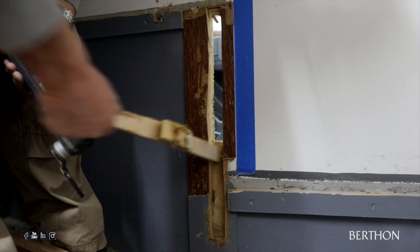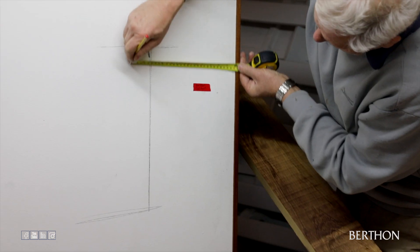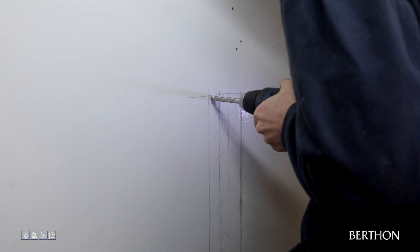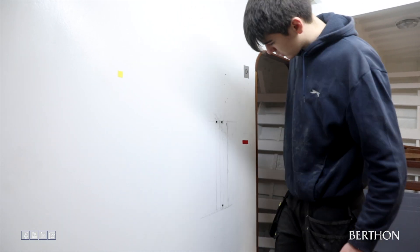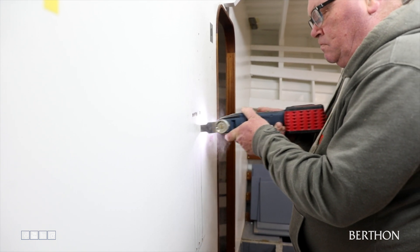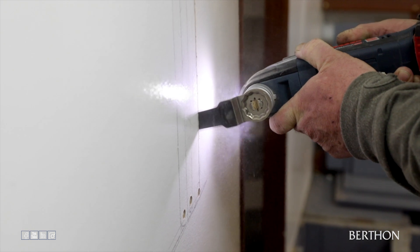The ends are also now let into the bulkhead to create a mortise. Quite clearly, once a frame or two started to delaminate owing to excessive stress, others nearby took the toll, and then the more movement there was, the more frames became dislodged, allowing moisture to wend its way in and cause rot. All of these changes will make her more structurally sound and far more rigid, hopefully negating the need for another refit soon.